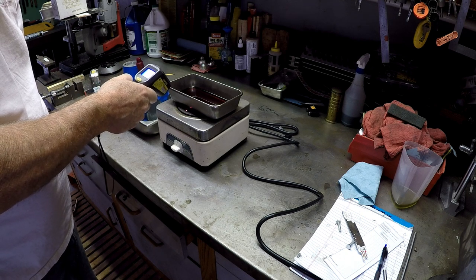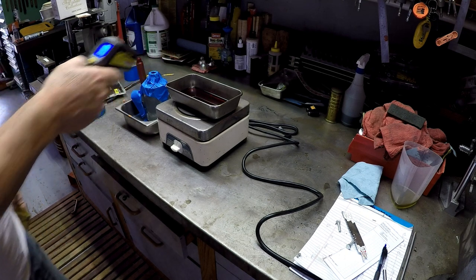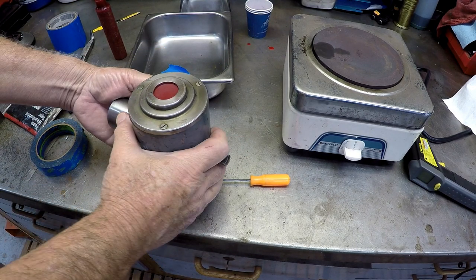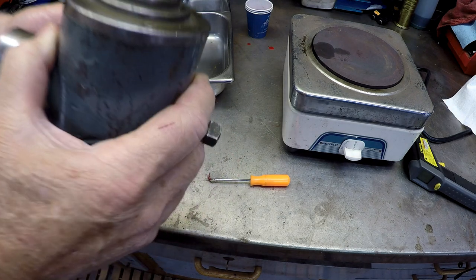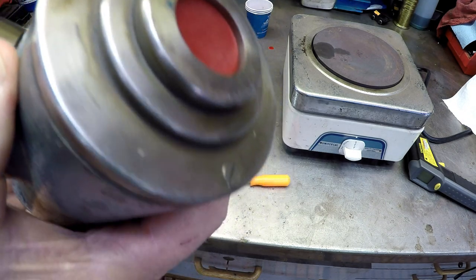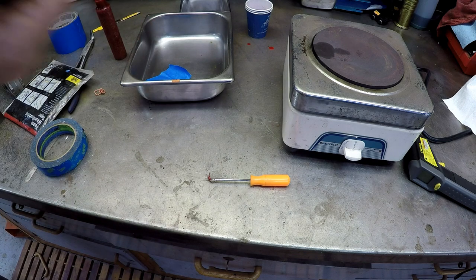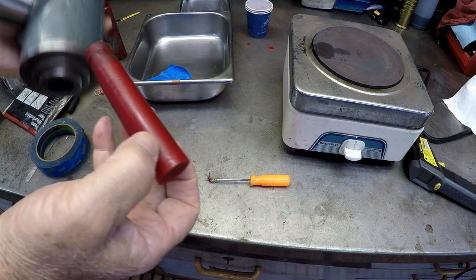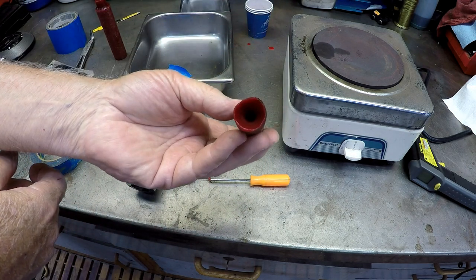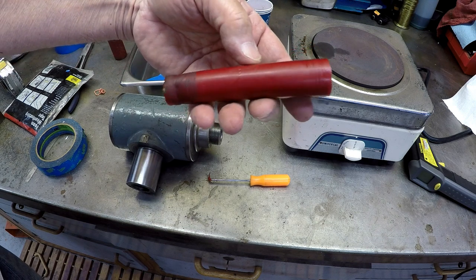The hot plate is about 340°, the pan is around 235°. The wax is dried — interesting enough, you can see the shrinkage that occurred as the wax dried, even though it was upside down. But I basically have a replica of that taper. You can see the shrinkage on the small end.